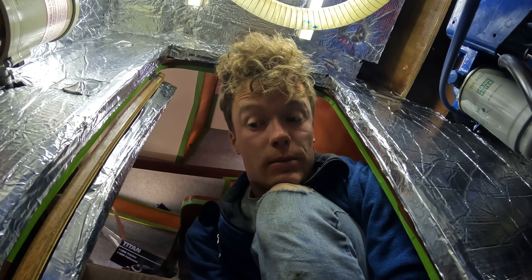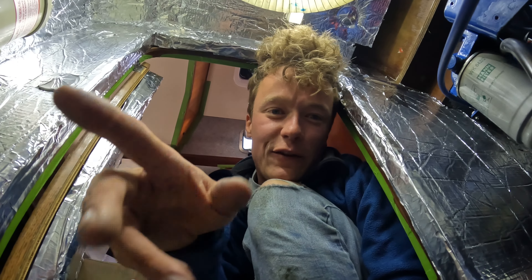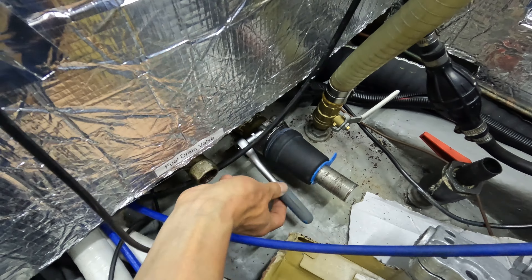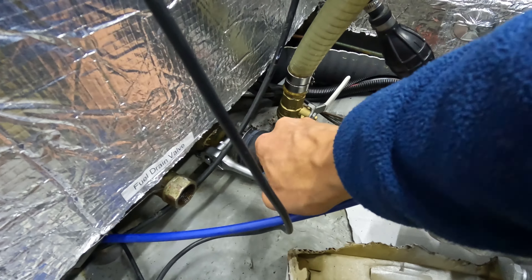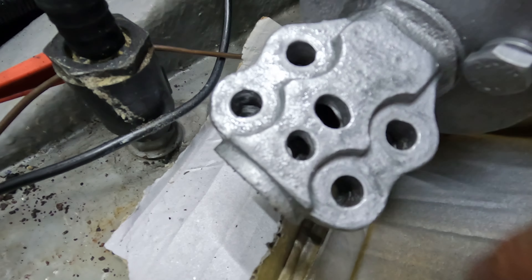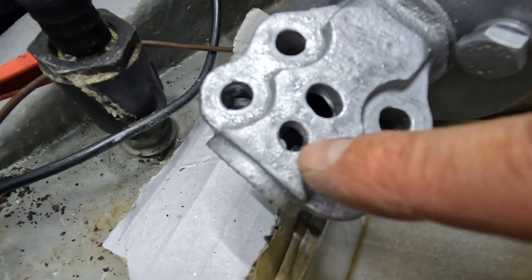This is one of the big jobs for us to tick off whilst we're on the hard, and it involves me doing a lot of things I've never done before — it's all kind of scary. But I'm just figuring it out a step at a time. The only problem is we're going to launch the boat after me installing this, and the first time we're going to find out whether I've done it correctly is when we launch — it's either going to be leaking or it's not. I'm replacing the old steel bolts with stainless steel — these are 10mm bolt holes, 10mm bolts, except this little one which is an 8mm hole.